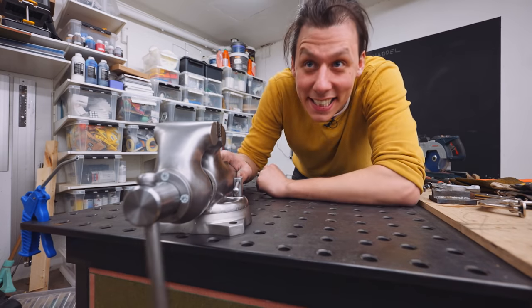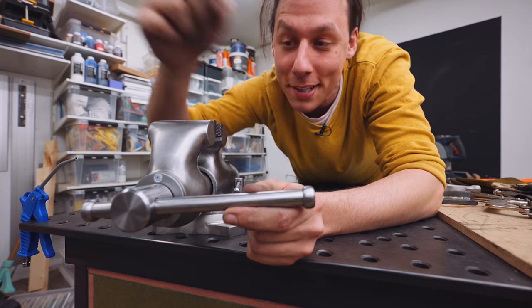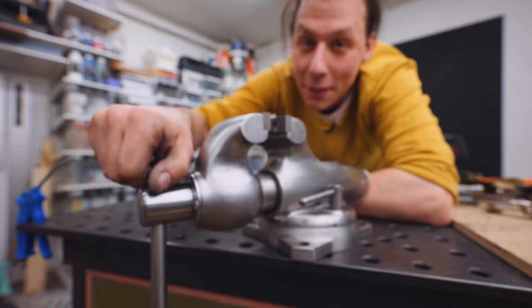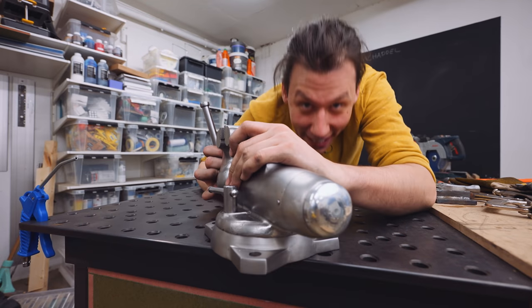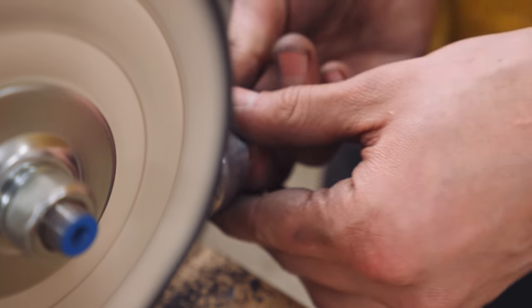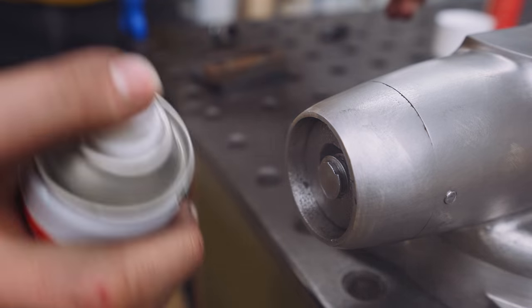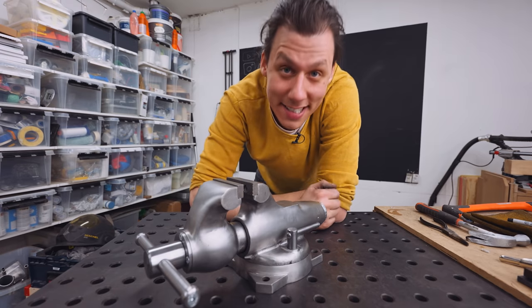Look at this — we got a really nice and functional handle! I just turned this shaft to the right diameter, threaded some holes in the ends, and made these two nubbins with countersunk holes, so now we have these really cool end pieces for the handle. And to finish everything off, I made this cap — just look at how shiny it is. I figured since I spent so much time machining and turning this thing out of aluminum, I might as well polish it. It's held in place with some super glue, so if I ever need to take it back off I can just heat it up and it will come right off. And with that, this project is done.